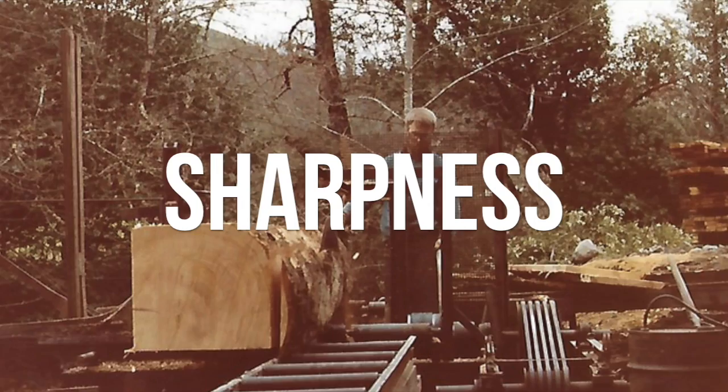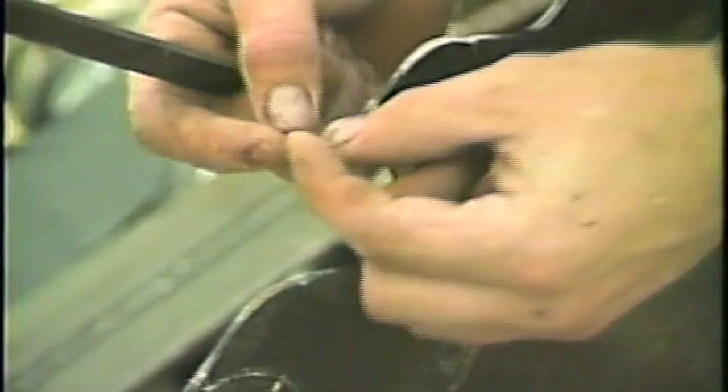If the saw is not sharp, it won't cut. If the teeth are not square, it won't cut straight. If the bottom of the bits don't have a uniform pitch to the filing, it will tend to dodge. If the gullets themselves are not sharp, they will not collect and hold the sawdust until it's discharged at the bottom of the cut.